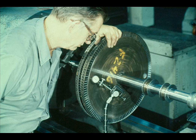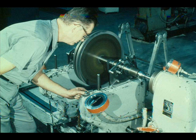The final indicator check to be made is of the face of the rotors — check both of them for run-out. The last step also has to do with the rotor assembly: it must be checked for dynamic balance, as the workman is now doing.